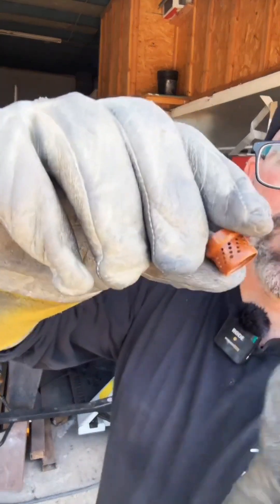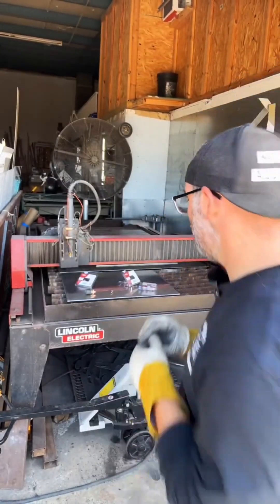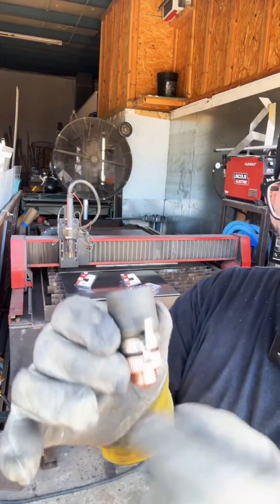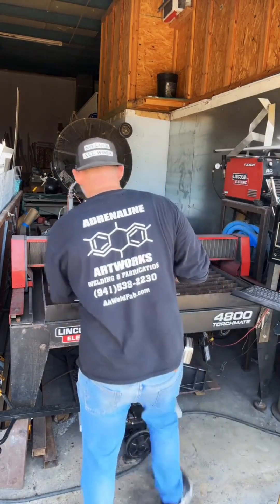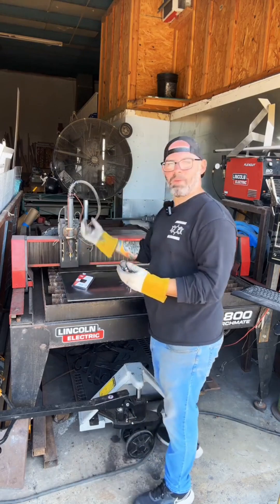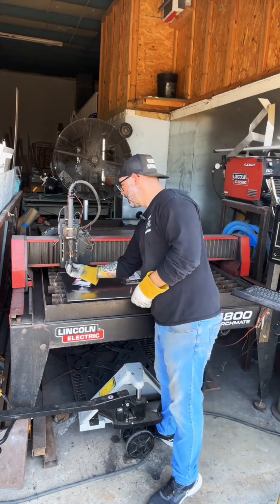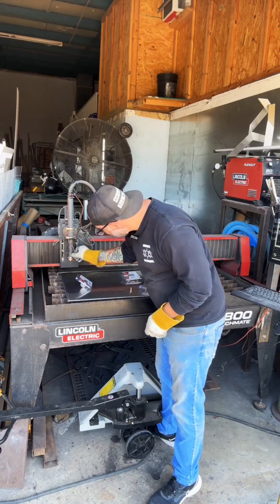On the back there's an airflow nozzle that goes over top of this. This piece goes in there, and then this piece gets screwed up onto the plasma torch. This little clip right here is where that little orange wire clips onto. So we're going to go ahead and put the electrode back up into the torch — you just push it up and it will seat itself inside. Then we drop it down, push it up in here, screw it all together, put the ohmic sensing wire back on, and we're good to go.